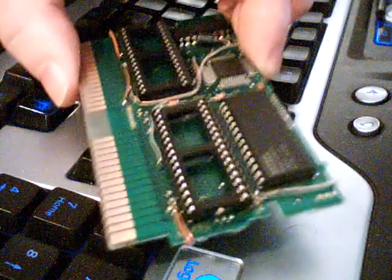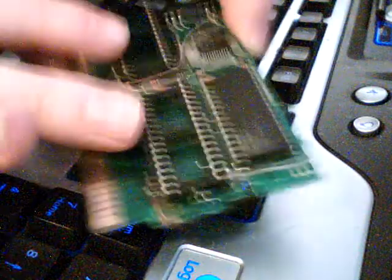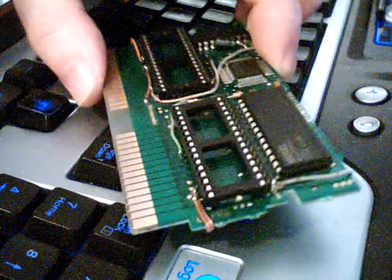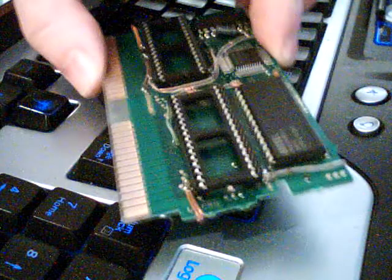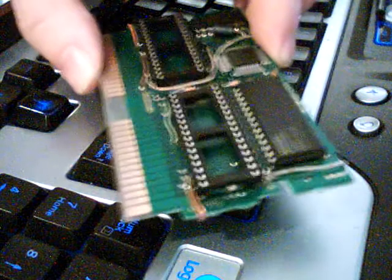The second step I do for actually making the cartridges after I program the EEPROMs is I use my test board. And the test board is basically just, this is my TS-ROM test board. It's basically just a board that I've removed the EEPROMs for and then wired in the sockets as you would wire in the EEPROM. So I can do quick tests, see if anything's wrong before I go through the trouble of actually soldering the EEPROMs to the board.